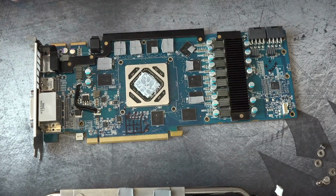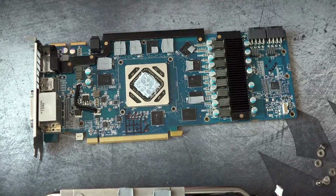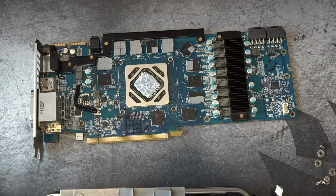And that is a normal response for any decently designed computer component when you trip a protection mechanism. Basically, with over current protection, there's no real current limiting. You can't tell the GPU, if the GPU core wants 100 amps, you either give it 100 amps or you shut down the voltage regulator. You don't tell it, no, I'm not going to give you 100 amps, this is just not going to happen. Because if you're outputting 1.2 volts and the GPU core's effective resistance goes low enough that you suddenly need 100 amps, you're going to move 100 amps or the voltage is going to drop. One of the two. And anyway, getting kind of sidetracked there.